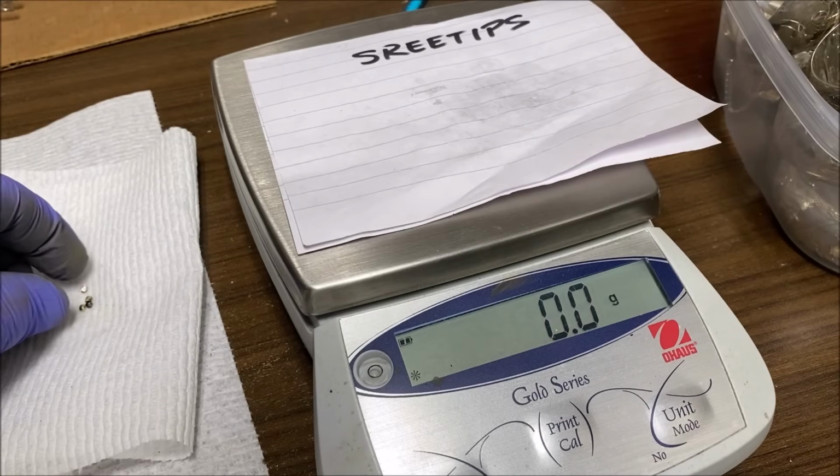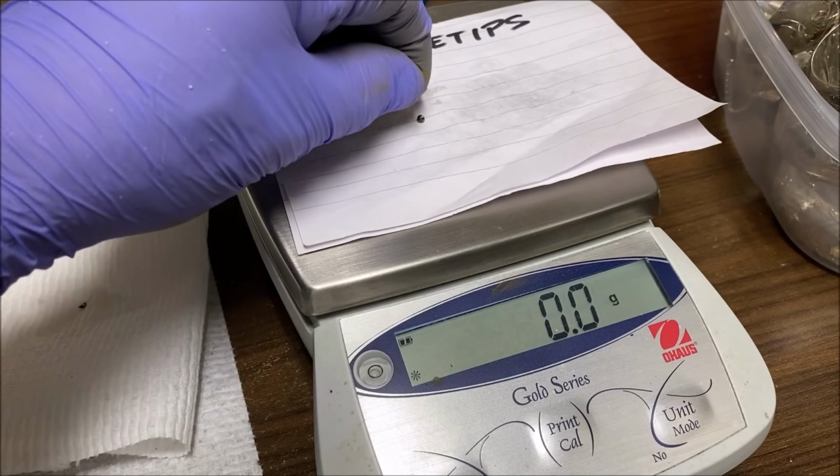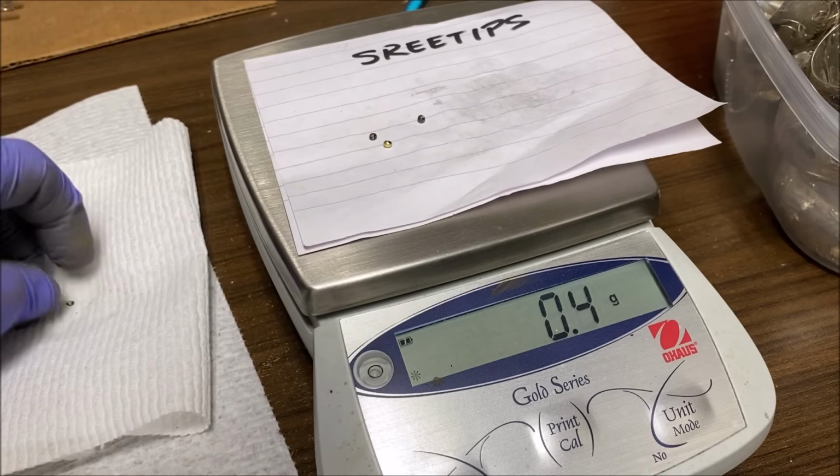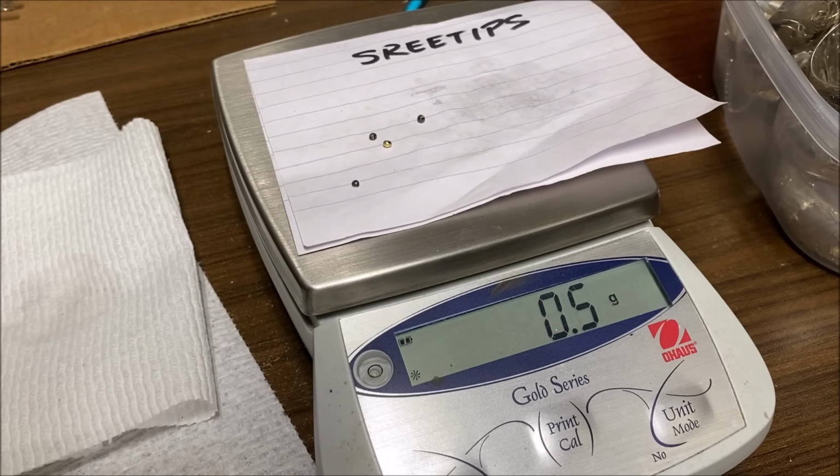Here's our tiny BBs of gold. It's not going to be pure. It's going to be contaminated with other metals. Looks like we got about 0.5 gram of gold from that recovery. What we'll do is we'll put that in with our next batch of carat scrap and refine it. This will conclude part 7 of the silver cell anode filters recovery. Thank you for watching.